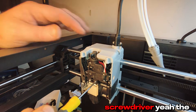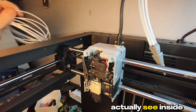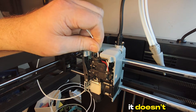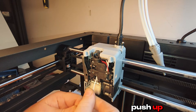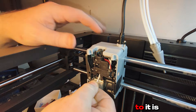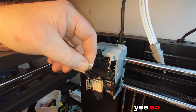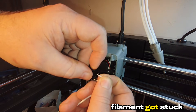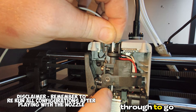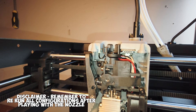Using the same screwdriver. Now we can actually see inside. Let's see if it even gets down that far — it doesn't. So what we can do is push up in there. Still doesn't want to. Aha — we got it! Yes. A little bit of filament got stuck cold up in here, between here and here, which is cold. That means you can't actually push the filament through into the nozzle. We took these two screws off here, then pushed up, and we were able to get that out.